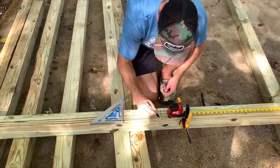Continue to install row after row of tar paper, maintaining the minimum 4-inch overlap up the entire shed. As you install the tar paper, don't be afraid to have an overhang over the rake sides and also the ridge. You can go back later on and trim it flush to the fascia boards using a utility knife, and that is so much easier than trying to pre-measure and pre-cut your tar paper to length.